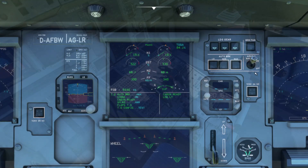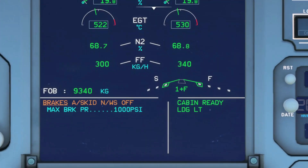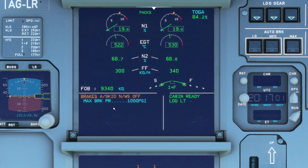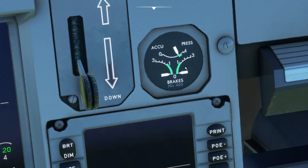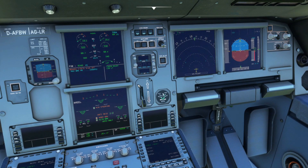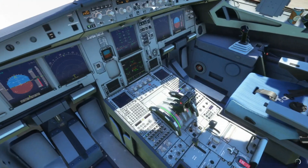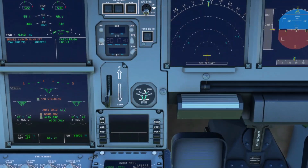However, if you're using alternate braking without anti-skid, this is where you want to be careful because you're limited to applying up to 1000 psi of brake pressure. On the lower part of the accumulator pressure indicator, that's where you see the amount of pressure used. The green arc is for the alternate braking without anti-skid. If you exceed past 1000 psi it'll lock up and damage the wheels. When you apply braking pressure you'll see it stops exactly at 1000 psi and does not exceed the limit. This is the correct way to prevent any wheel lockup.